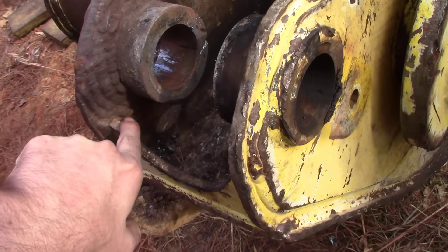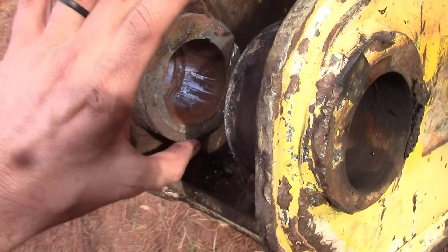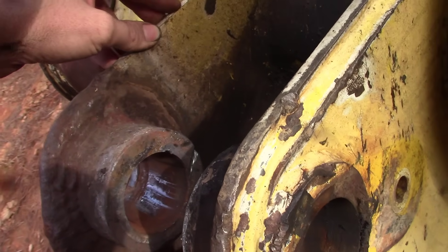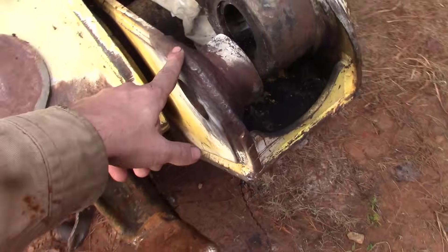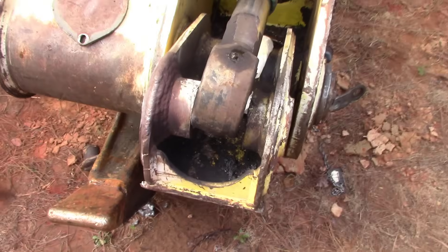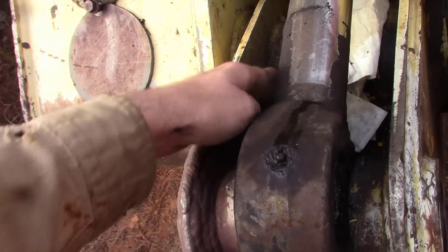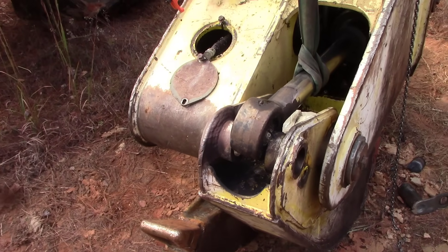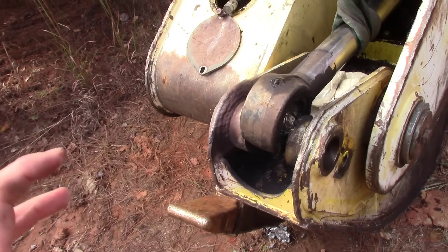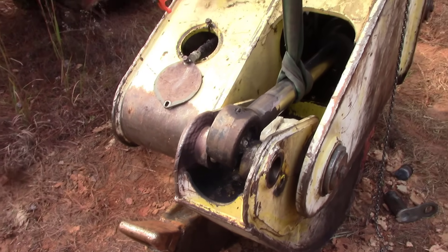So the plan is to cut all this weld off, repair this crack, and we're going to make a little plate that looks similar to this one. We're gonna go around this boss and weld it into this ear to prevent this from happening. You notice it does the same thing on the same edge - you can tell there's a plate welded to it. My guess is it allows for more of the stress instead of being focused around this boss, it pushes it further into the actual plate so you don't have just a hard area where all that stress is taken up.